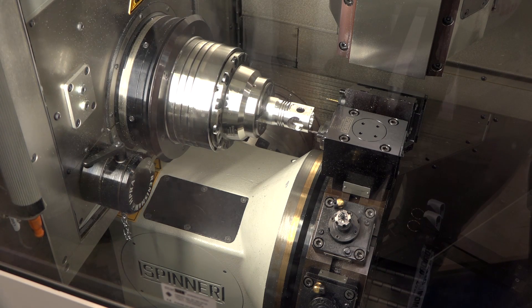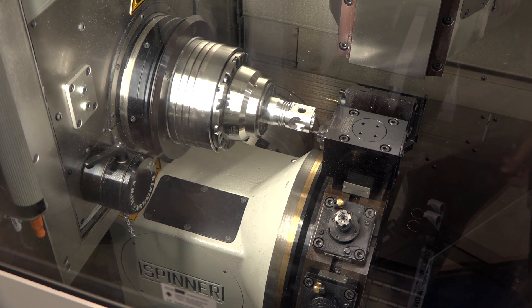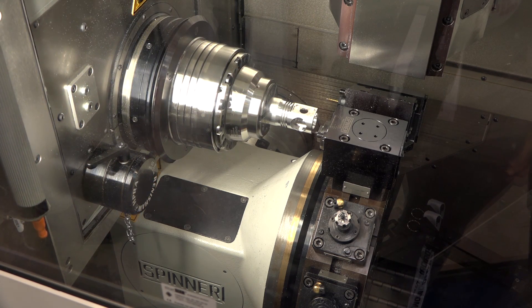How do you achieve that? Is that the way the machine's built? Yes, it's part of our unique design and also of the technology we have in producing the components of the machine, such as the spindles for example. We produce our own spindle heads which have a sub-micron precision in roundness on the turned workpiece, so these two combinations from the design and from the parts production bring the precision.